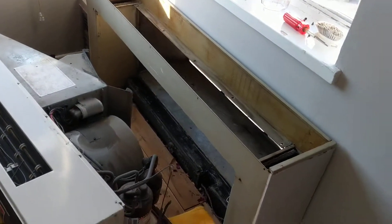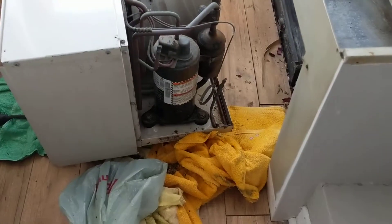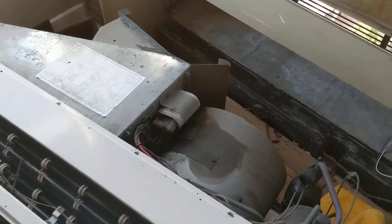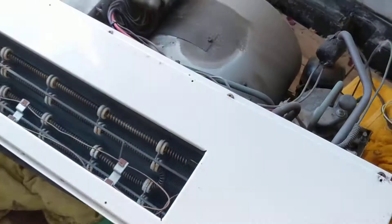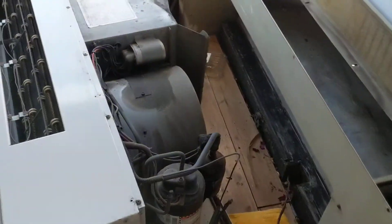After those screws were out, this whole unit just slides right out. It's super heavy, so don't do it by yourself — have two people do it and put a towel on the ground. Once the unit is out, unplug it from the 220 and unplug it from the thermostat. It's just one cord that plugs in here — only two things you need to disconnect.